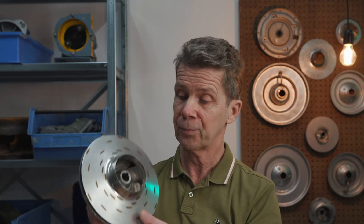Because you can fill this pump housing completely, the impeller is nearly completely below medium level. Because it is below medium level, this pump can be a self-priming pump. When talking about a normal pump, the medium level is just about halfway — nearly half the impeller diameter. I can show you the inside of this pump.